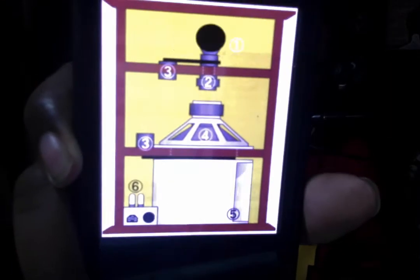Why is this speaker so important? Well, here's why. In this speaker, there are three compartments: top, middle, and bottom. The top and bottom compartments are where the sound comes from. What makes the sound of this speaker so special is that on the inside it has rotating parts. The top, where you see the horns, is for your treble. The bottom rotor, the white part that's moving, is your bass rotor. The middle compartment has the subwoofer facing down, firing to the rotor, and the driver that's facing into the horns.